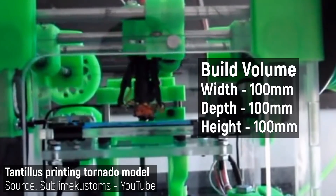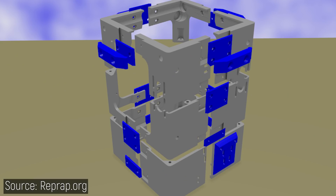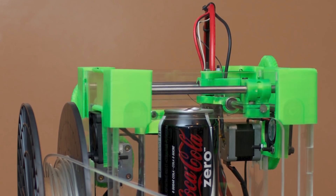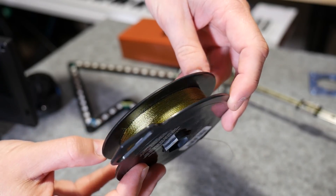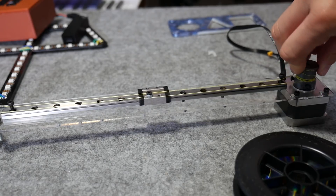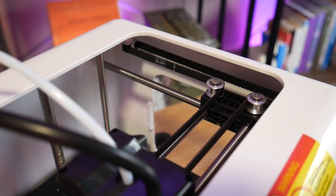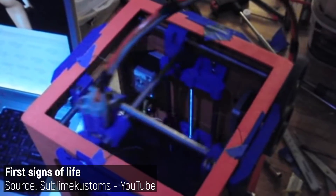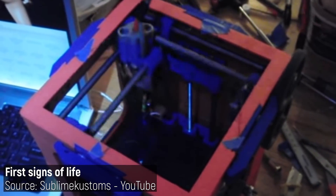Most people could barely get anything over 100 millimeters across to print without warping or failing. Despite being tiny, the build volume was a semi-usable 100 millimeter cube, which could self-replicate by printing the frame in parts and gluing it together. It was able to fit that much movement into such a small package thanks to its innovative use of braided fishing line to transfer movement from the motors to the movement axes. Unlike more traditional mono fishing filament, braided fishing line is created from braided synthetic fibers like Spectra or Dacron, and it's incredibly strong with very little stretch. This combined with the Ultimaker-style XY movement configuration created an incredibly well put-together design.